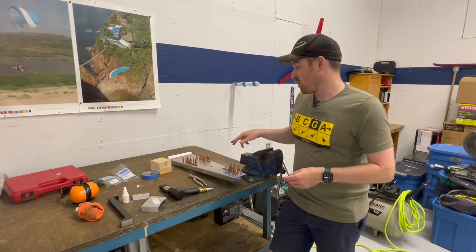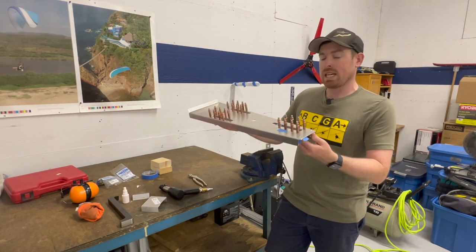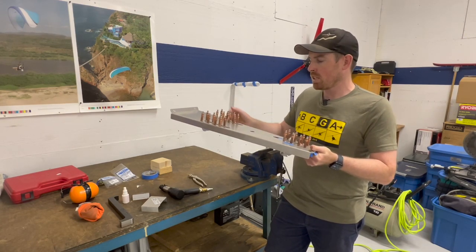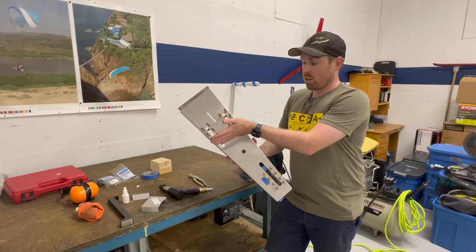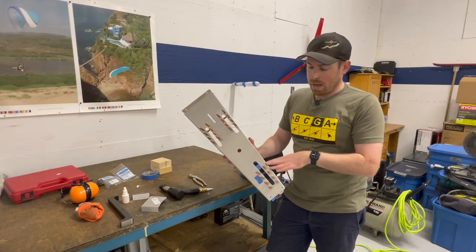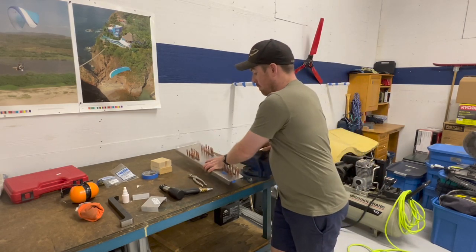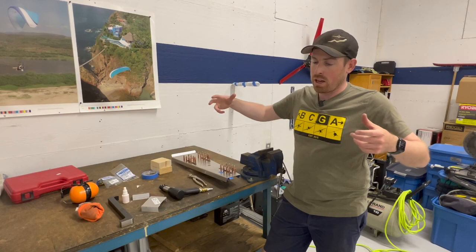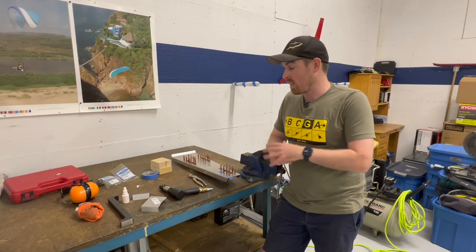Another builder, a guy called Kevin Olson, gave me some advice on the builder forums. He talked about how when he did his, by the time he went to put the center console back into the fuselage, it had bowed a little bit. Keeping that in mind, I'm going to start riveting the adjustable rudder pedal brackets from here going this way, then do the flap handle bracket and start here going this way. That should mean any pressure applied with the rivets going in would be outwards, lengthening the console rather than bowing it inward.